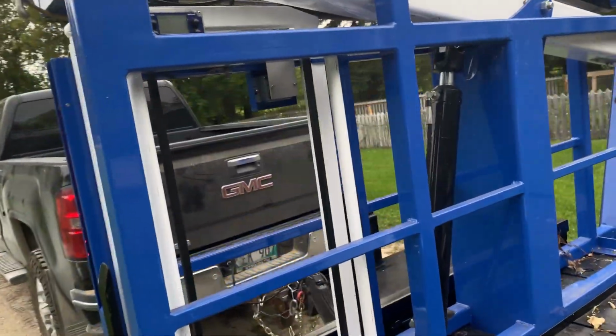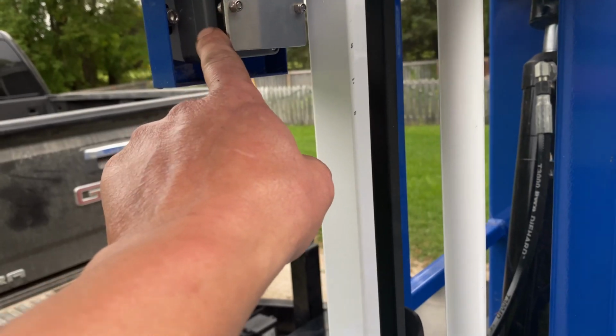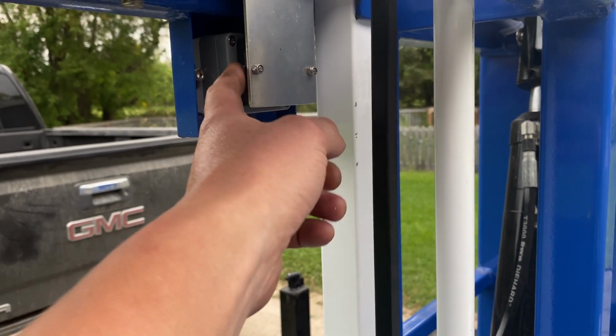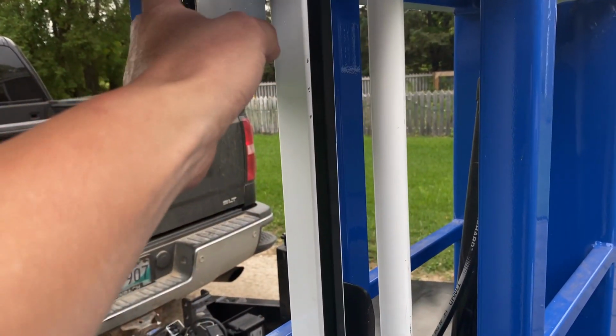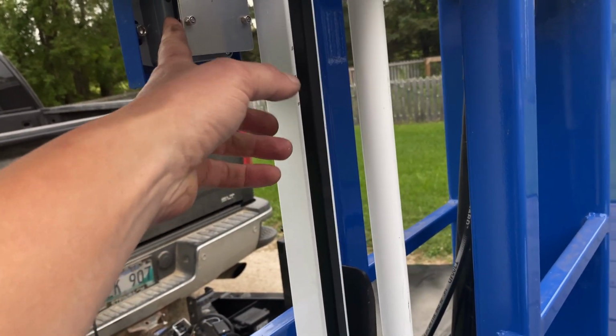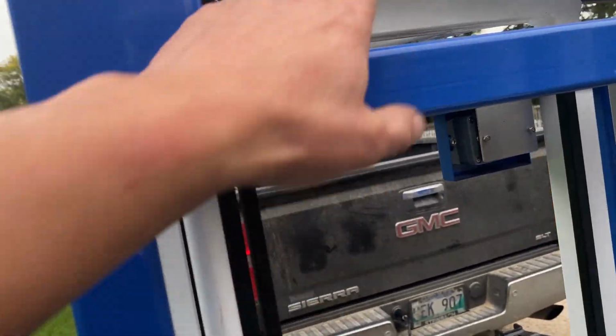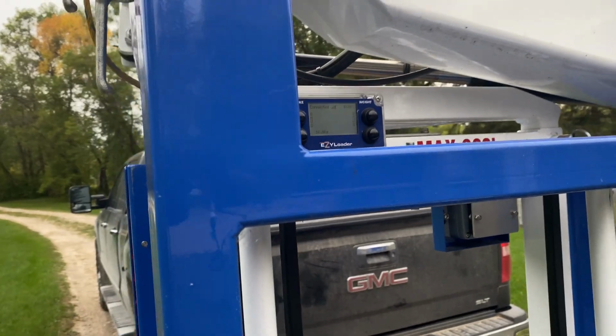But this remote is rechargeable and it is being charged by a contact unit here, similar to what your iPhone or whatever has when you lay it on a contact pad. That's what it's doing right here, is it's recharging the remote batteries. So if you're going to replace these batteries, you have to use rechargeable batteries. Keep that in mind.